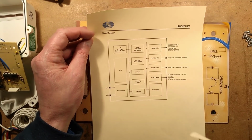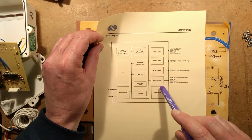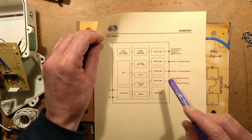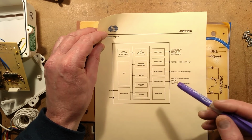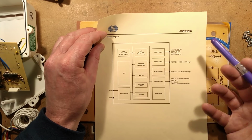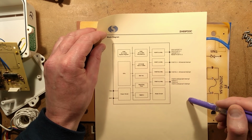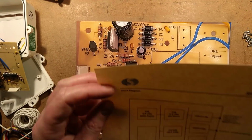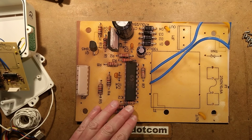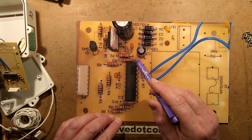After that, fundamentally the block diagram of the processor is that it's got four 4-bit ports which account for the 16 pins that have I/O facility, and then 2 power pins. That makes up the 18 pins. And it's just very standard. These pins also double up as reset and other options, the external oscillator. Things worthy of note: the reset pin is used. They've got a 330K from the positive.